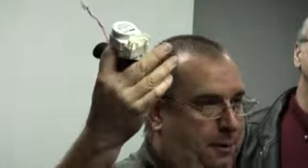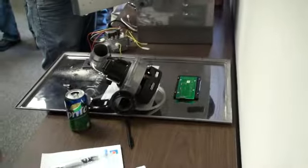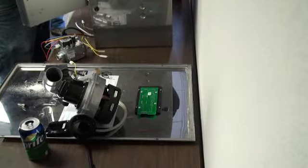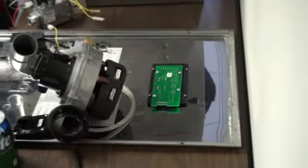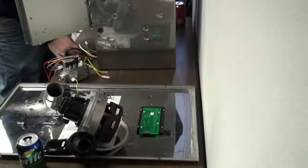With no control to the pump, this poor valve can't take it. This valve was made to take 50 degree water into it and make it to 120 - it wasn't made to take 120 degree water and try to make it 120. So this little actuator head just goes and doesn't stop and finally ruins the valve. Get a new mixing valve before you go to the job site. They can reset it, but if you let the E27 linger for a month, you might get to the point where you can't reset the E27 anymore - that means the valve is seized up completely. You don't want to get to that point.